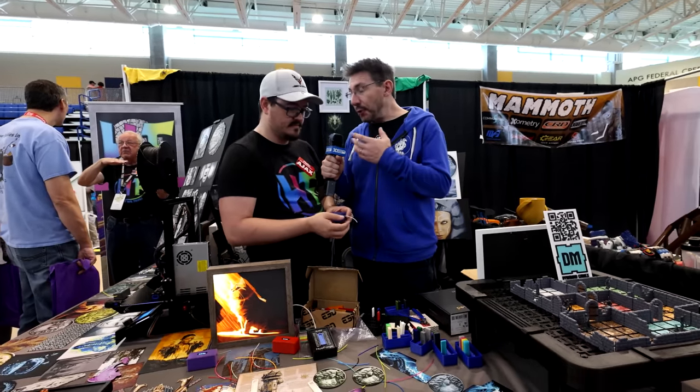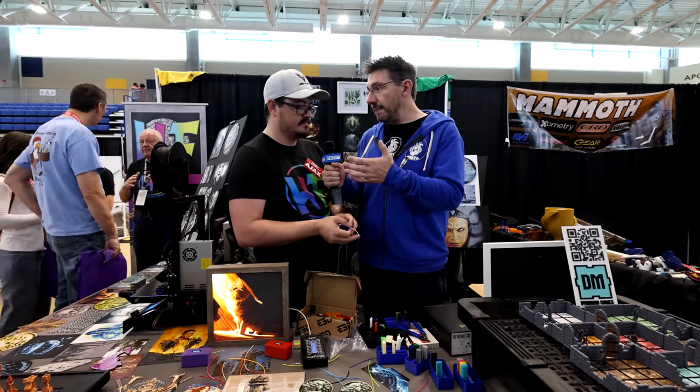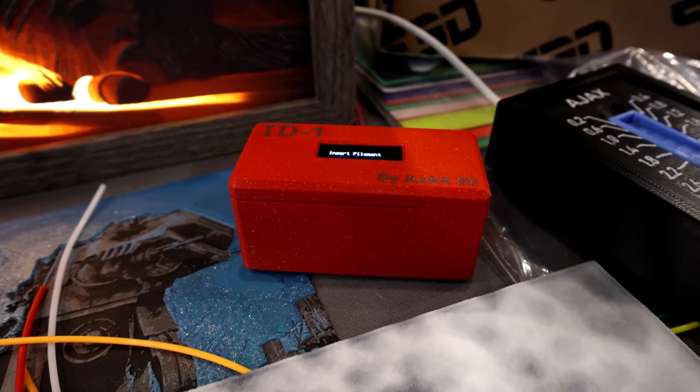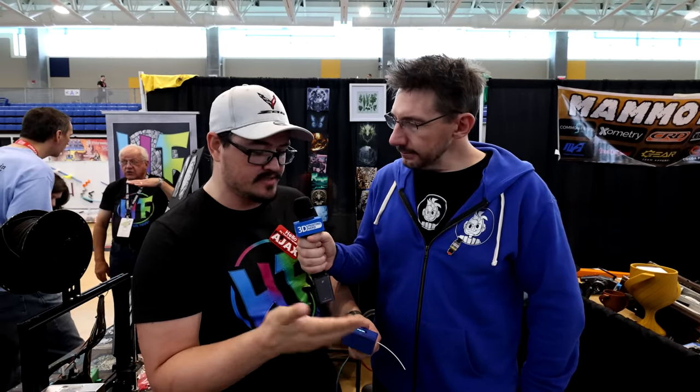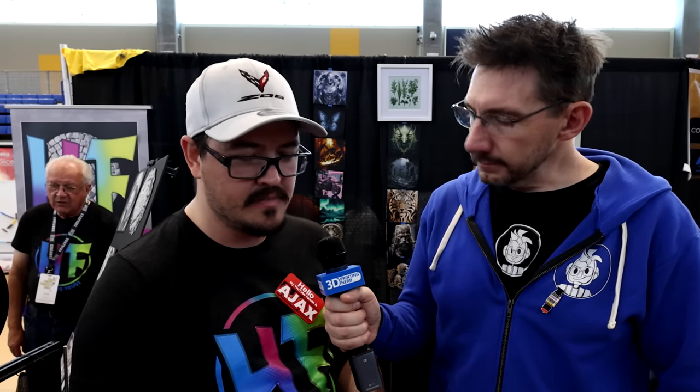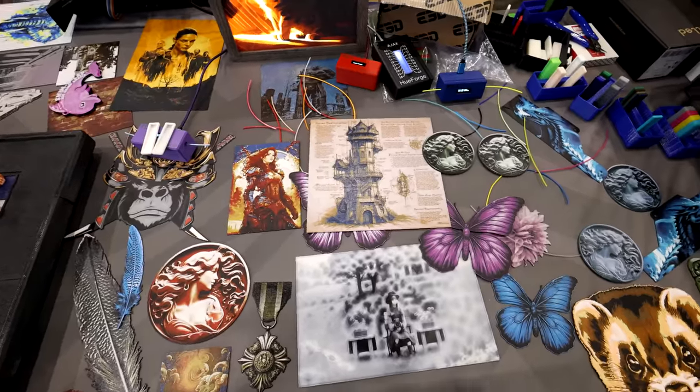Does the future look like putting together kits for people to purchase? Absolutely. To make the process even easier, rather than having wires to solder I developed two PCBs through PCBWay — not sponsored — so the boards are unpopulated currently, but you solder headers onto them and it all just snaps together with no loose wires. There will be an option to self-source, with a firmware license for around five to fifteen dollars, as long as you use the same components to maintain consistency. They'll also be available pre-built and ready to go.